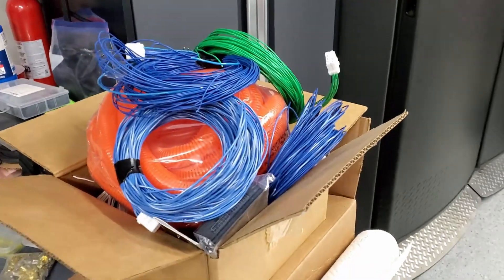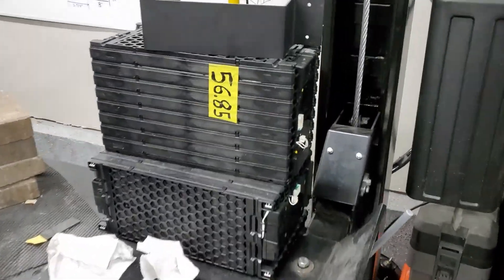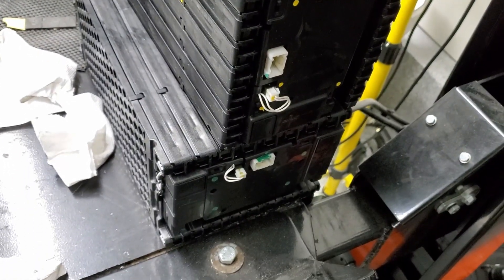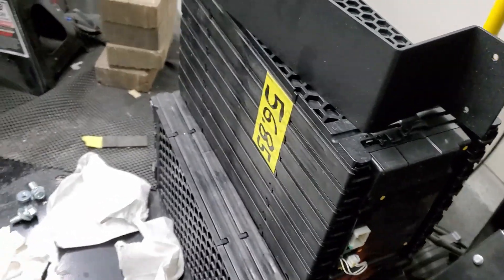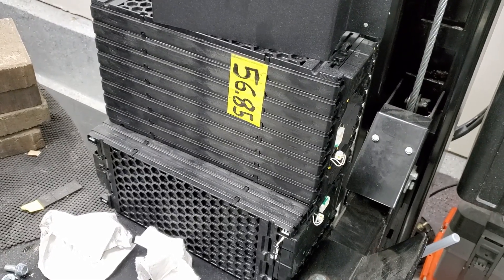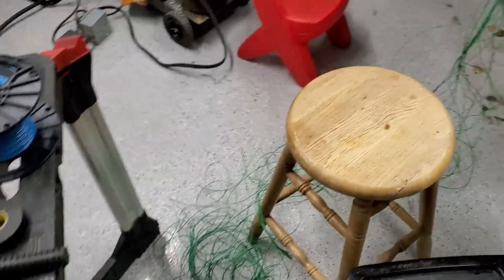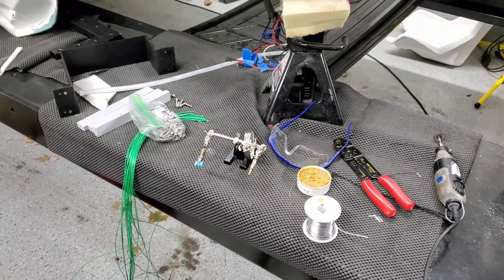So I've got kind of four of the wire packs done, and I've got four more to go. The thought is I'm going to be measuring each individual cell, and there are I think four thermistors in each battery module. The BMS that I have allows for 40 temperature readings, but I'll have four. I've got enough. I'm going to go ahead and do the other four. It's just a mess getting all these wires put together — a lot of soldering. I'll go ahead and do a time-lapse just so you can see some of it.